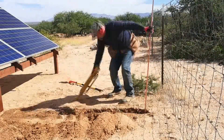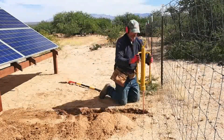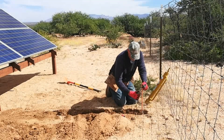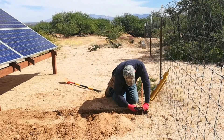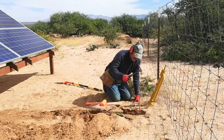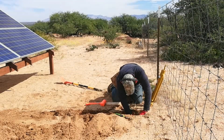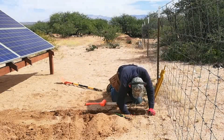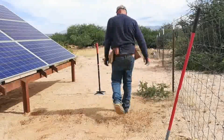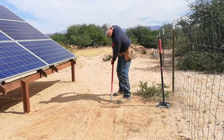This is an eight-foot, 5/8 inch grounding rod and I'm using my T-post pounder - a lot easier than trying to hit it with a hammer and it goes in pretty quickly. It makes a lot of noise so wear ear protection when using a T-post pounder. I'm putting the grounding lug over the grounding rod, securing the copper wire to the grounding lug, then hammering the rod home. I'll find the final position for the grounding lug, secure it with its set screws, then backfill and give it a quick tamp with a hand tamper so it doesn't collapse underfoot.